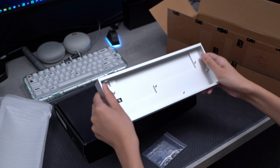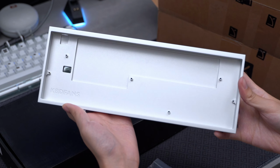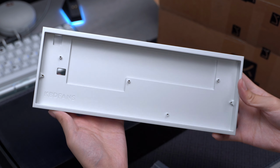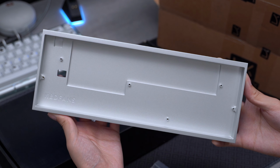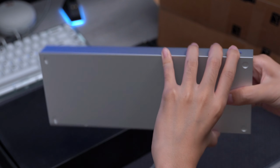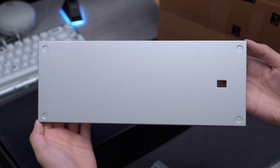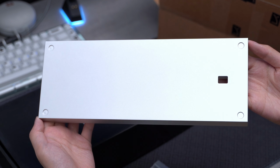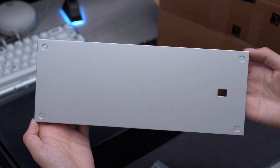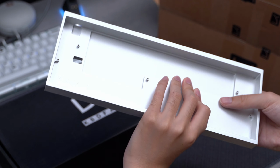The Tofu that I use for this project is the silver aluminum. The polishing process removes the anodization coating anyways, so the starting color doesn't really matter. However, by starting with the silver, I knew I wouldn't have to worry about the various holes in the case not matching the color. I chose the Tofu case purposely because it really is just an aluminum box, so working with it should be really easy. Cases that feature rounded edges or fillets would be a lot more difficult to work with.